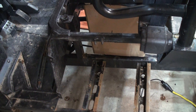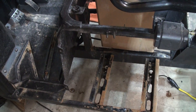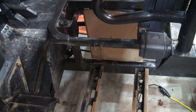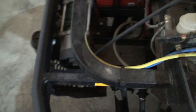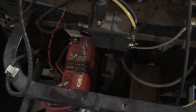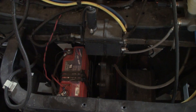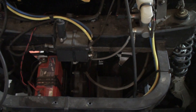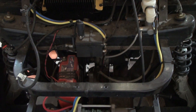That's all we've got to update until we do some cutting and welding and get these batteries fit in here. That'll be at least another month or so. The front differential is also probably going to have to come out — the outside bearings on that front differential seem to be pretty loose and they rattle around and make noise, so that'll have to be redone as well. We'll do some video on that. Thanks for watching my channel, I'll keep it updated.